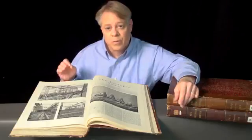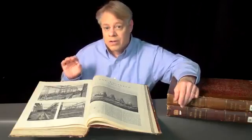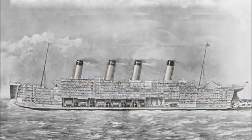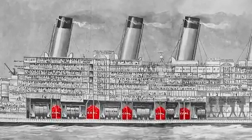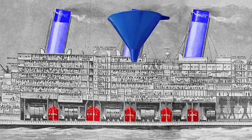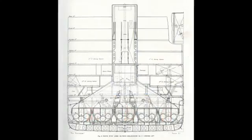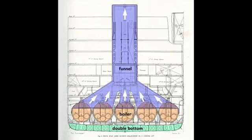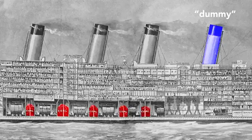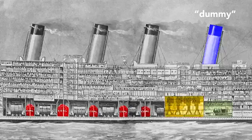Despite these accidents, the Olympic-class ships were great feats of design and workmanship. Just consider the propulsion system of the Titanic. The ship had two sets of reciprocating engines, fueled by coal which was stored along the bottom of the ship. Exhaust gases from the boiler discharged through these smokestacks, which are frequently called funnels. They are upside-down funnels. This cross-section of the Olympic shows the boilers sitting atop the double bottom. Exhaust from the boilers is funneled up and out of the ship. It's well known that the aft-most funnel on these ships is a dummy — it was built primarily for aesthetic reasons. Although it did not service the boilers, it was used as a ventilation and extraction shaft for the engine and turbine rooms.